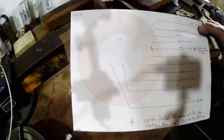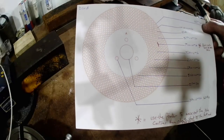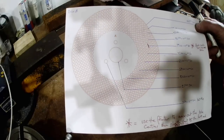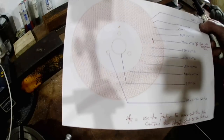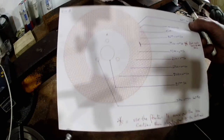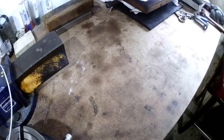Therefore the combination of 51 up to 100 indexing holes will enable the full sequence of 10 to 100 teeth to be formed. In order to make sure that such a large number of holes can indeed be cut onto a 6-inch blank, I used a CAD package to help me devise a hole pattern to fit on as few plates as possible.